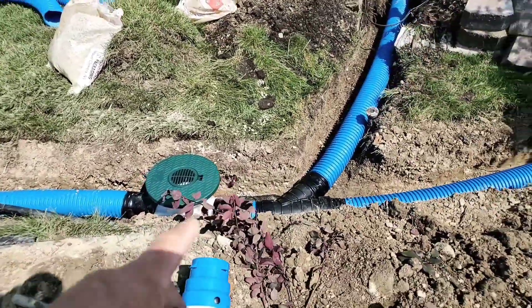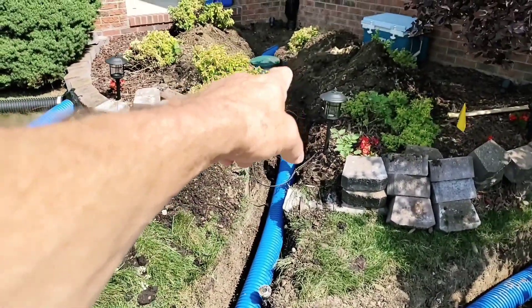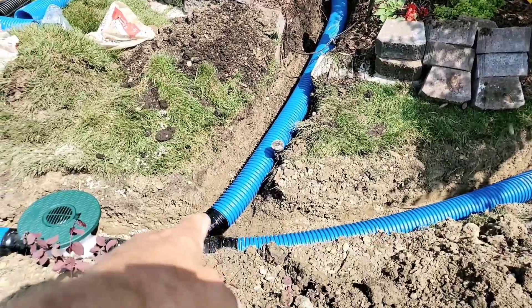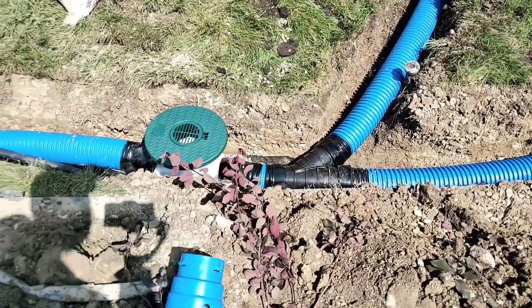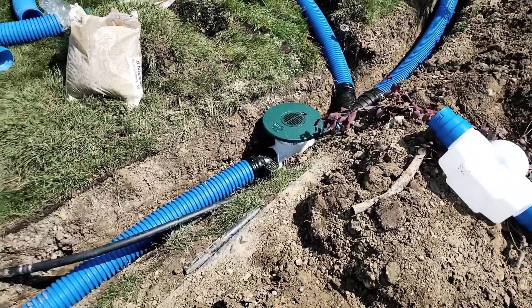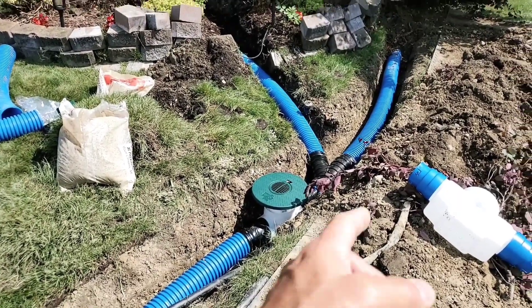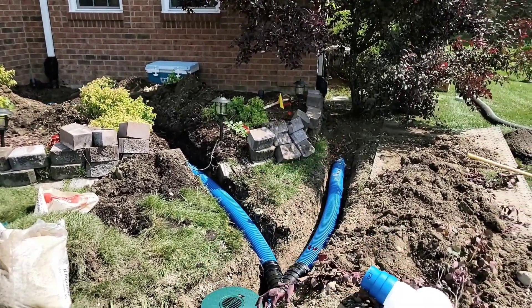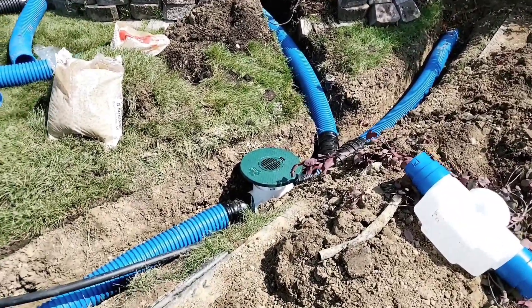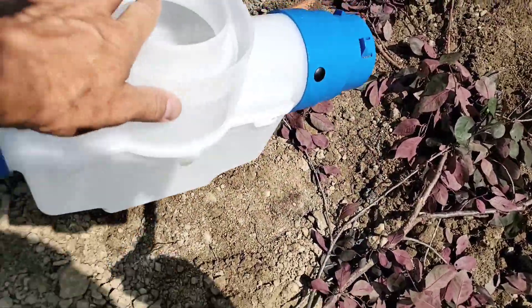The way that install turned out, you have an inline catch basin catching the shingle gravel and sediment upstream. That line actually gets filtered twice — any sediment that may be carried will end up getting picked up in this secondary inline catch basin that's meant for this line. It's a really nice, well-thought-out system and the guys did a beautiful job.